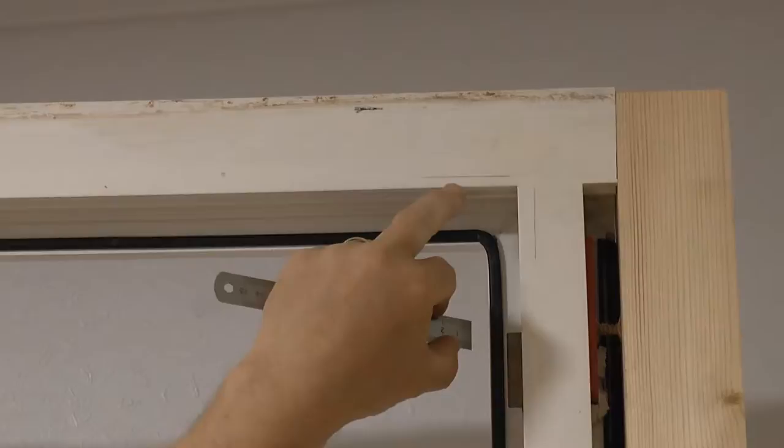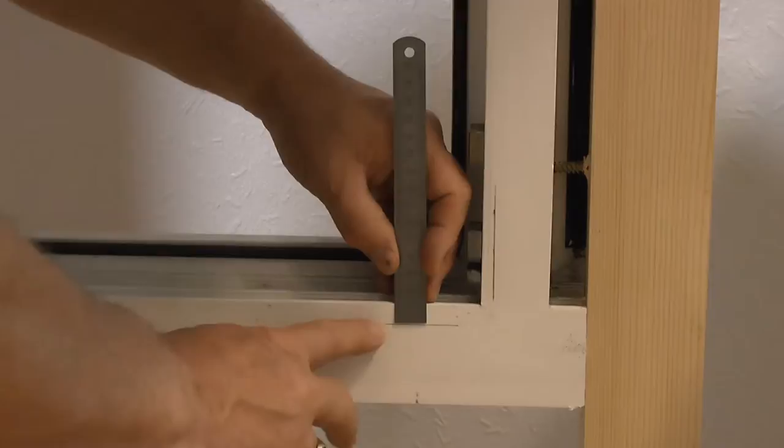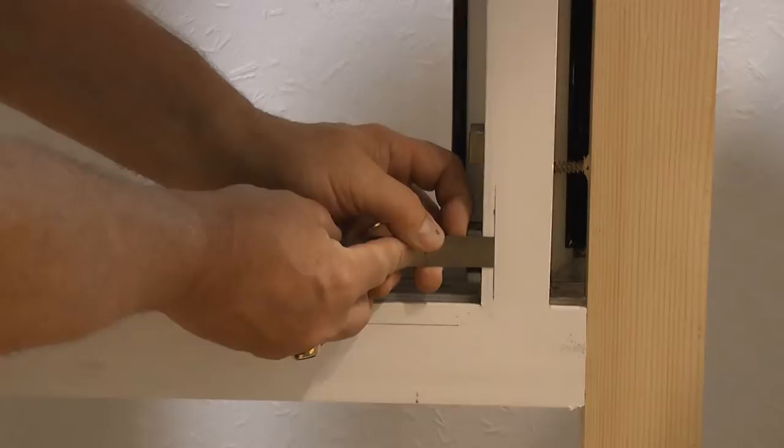Consequently we have more overlap at the bottom of the window, and checking the side here that's within tolerance. It's indicating that the sash has dropped slightly, and it may be that towards the end of the exercise we will reposition the sash and have to adjust it by re-wedging the glass within the sash, which will be explained later.